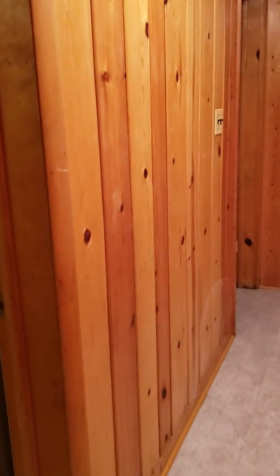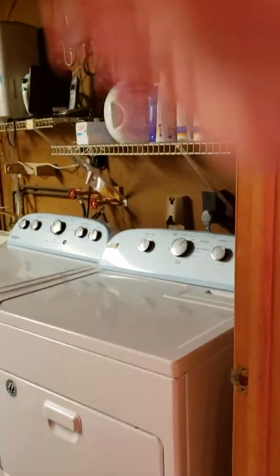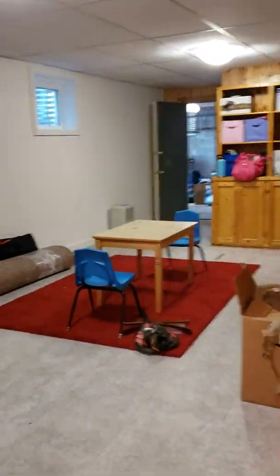So that's what we've got — all the way from the toilet, plus the floor drain here. We need to make sure that the laundry and the kitchen line, which are coming down here somewhere — I couldn't see them as I was looking in here — make sure that they're reconnected as well. New main line all the way through, 75 feet.